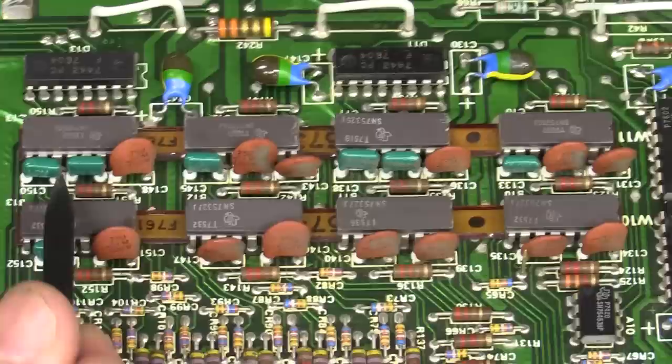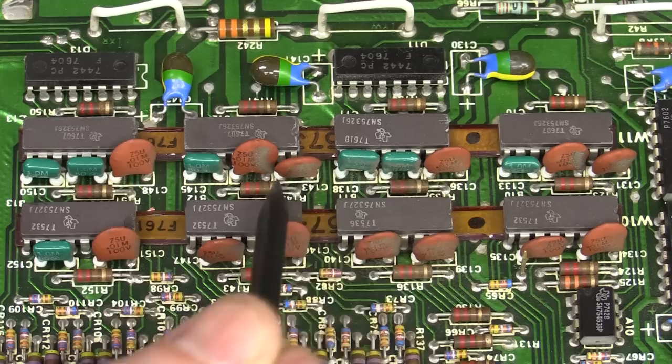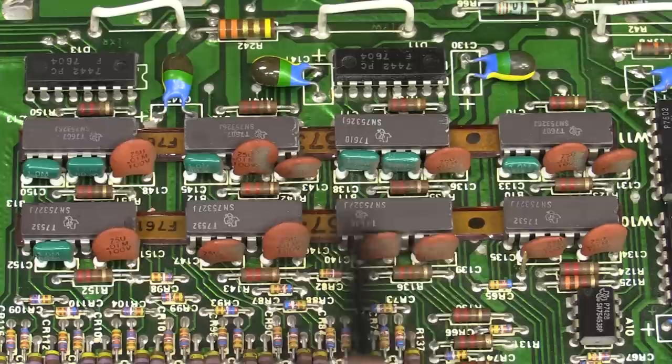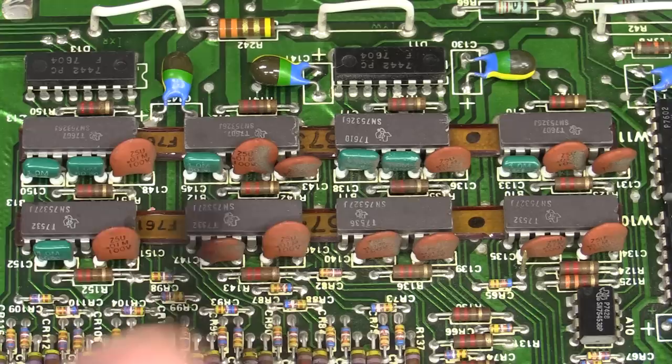These were very common back in the day. These are actually decoupling caps that run under the chips and then go down into the same holes as the chip. So you put the big decoupling cap on first, and then the chip through the holes. They would be totally custom made for the particular pitch between the chips in here, and then inserted into the particular power pin holes. You used to be able to get generic ones, maybe you still can, that go into DIP packages like this, and they'll have one pin over here and one pin over here for power and ground, for example. But this would have been custom made, and it's a bulk decoupling cap for all of these chips here.